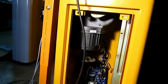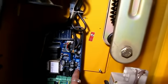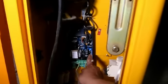You can see the barrier is closing down as this motor is rotating — this is the manual operation. Suppose there is a power failure and you want to operate the barrier: the power light is on and the limit switch is on normally. If I switch power off and there is no power, this is the handle — with the handle you need to rotate.